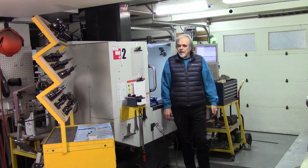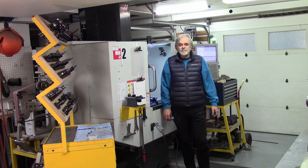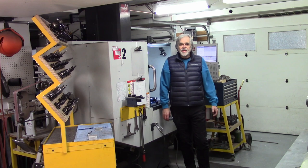and this project is no different. I'm going to have to make a custom fixture, at least one, probably three custom fixtures, that will hold the pieces in place as the outside is being milled. I typically mill the inside first and then put it on the fixture and mill the outside. So anyway, that's all for right now. Turn the camera back on for the next operation.